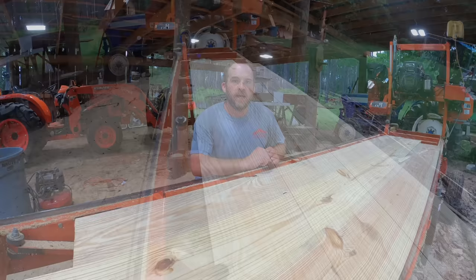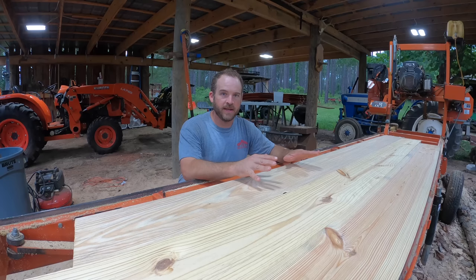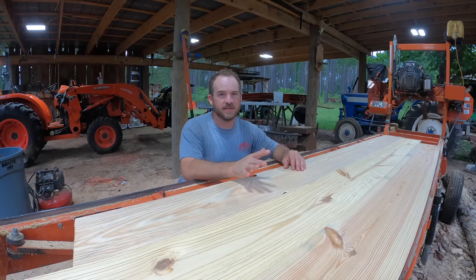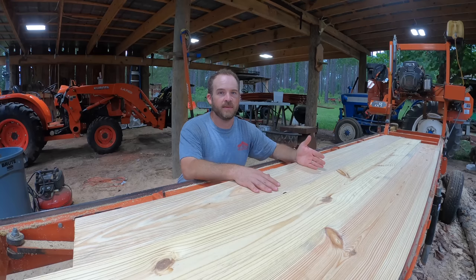I mentioned earlier in the video that these boards have the same moisture content as some boards that had been sitting in the house for a while, acclimating to the moisture level inside of the house. And I did some more testing on some of these, and it turns out there's actually kind of a variation, and I'm not totally sure why that is. I suppose some boards must have been stacked longer than others, but anyway, there's a variation between 12 and a half and about 15.3, something like that.